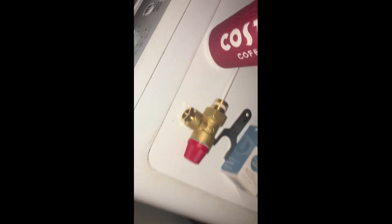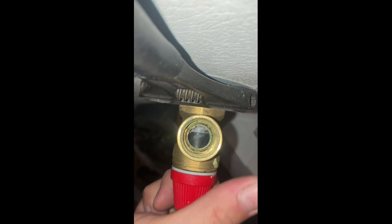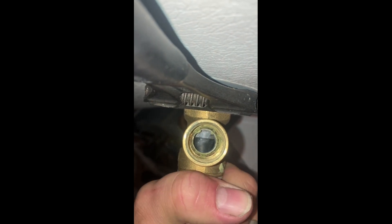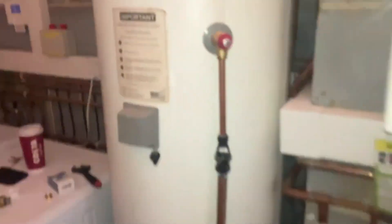I'll just let it fill up. Whilst I'm taking this off, I just wanted to show you how this works - when the pressure gets too much it pushes on the spring and opens up that washer, then springs back down, and that's when it starts to leak. So - old one out, new one in, turn that and screw that back in all the way, and reconnect this in there. Then we'll fill it back up and once that's done we've got the new one on there.